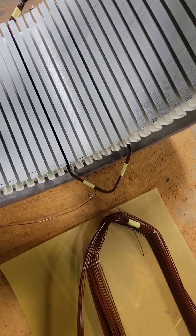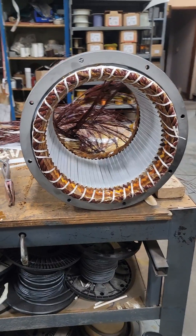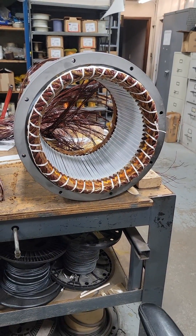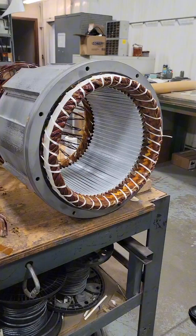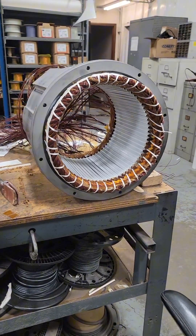I did change the shape of the coil from a round nose coil to a diamond shaped coil, and this actually is going to save us some copper. We're probably about 10 hours into this job. We got the entire winding in, we got the one end tied, now we're going to have to make our 72 connections on the other end and then we're also going to epoxy or encapsulate this winding, basically to keep it safe from dirt and debris.